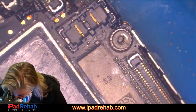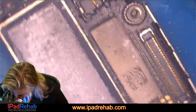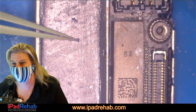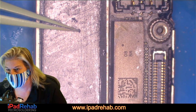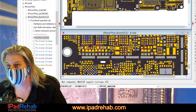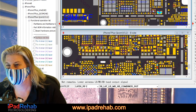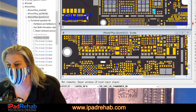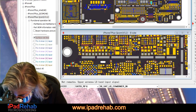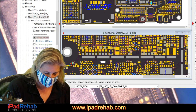All right, so this one has a 200 milliamp draw. Let me look to see what is under here in the 7 Plus. Let's look on ZXW. I don't like to take this shield off for the same reason. It generally is just adding a variable rather than eliminating variables. But let's see, what is under there in the 7 Plus? Right here. Yeah, in the 7 Plus, what's under there is a whole lot of nothing. Could any of this stuff, if corroded to heck, be the reason why we have a short? Oh, I just don't think so. All right, but I guess we'll take it off. Unless you guys have another idea, we'll take it off.